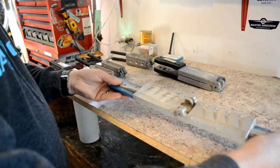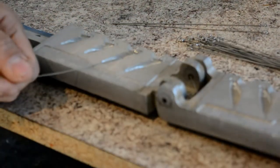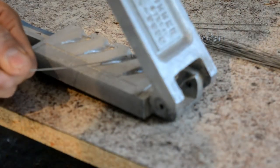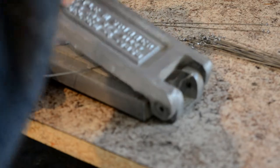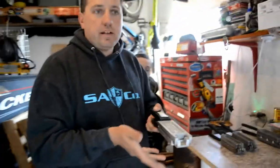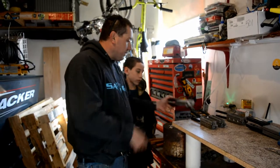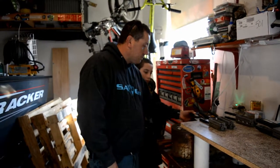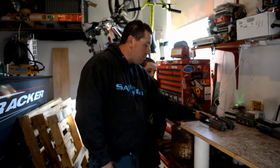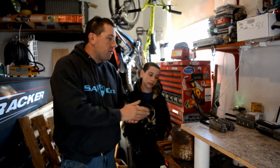This last mold would actually be more for Erie Dearies, and you have to get creative as you put them in because the wires want to fall out — you can't just lay them in like a hook. My trolling sinkers have more lead to them, so chances are you're going to get a short shot, meaning not enough lead getting into it. So I'm going to sit it on the edge of the pot and that'll warm up the mold as the lead is warming up.